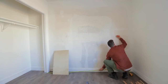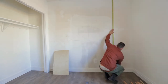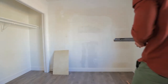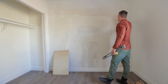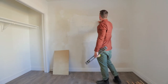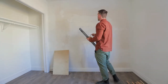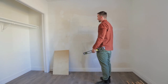The room measures 103 inches wide, and to my molding it's 95 inches. With a 95 and one-quarter inch high wall I'm going to have three breaks, so that's about 31 and three-quarters per section. I'll do three quadrants going up and the same going across. At 103 and one-quarter wide, divided by four, that's about 25 and three-quarters per box. I've already done my first mark at 31 and three-quarters to the ceiling.